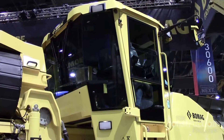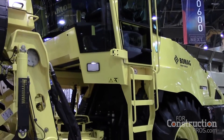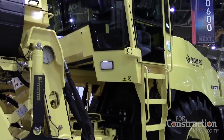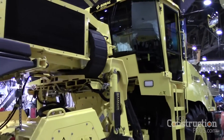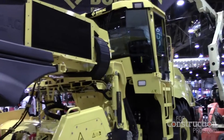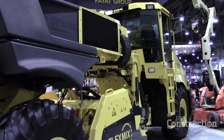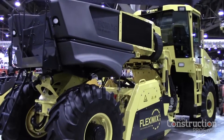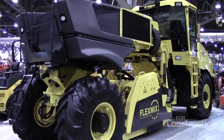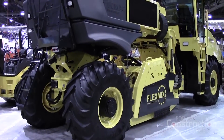The power is really significant here too, because this machine is not just a stabilizer — it can actually chew up asphalt and do demolition work. That's right. It's recycling and stabilization: stabilization of wet clay, cohesive blue clay, to stabilize with lime or cement, or to pulverize asphalt. For that, a lot of power is needed. Our rotor is hydraulic on the left and right hand side, so we can pulverize asphalt into small pieces, mix it with the ground, and use it for new base.